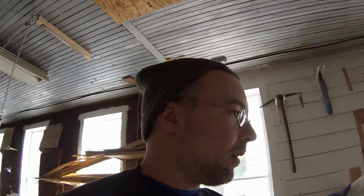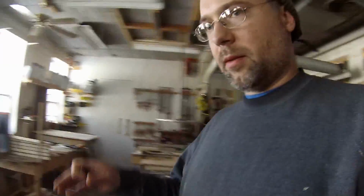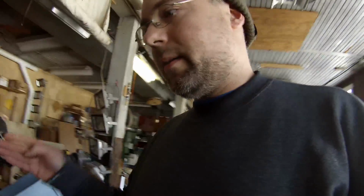That fine dust that permeates all the space inside the shop is the dust that's the least healthy for you, the most hazardous, and the biggest problem that you have to deal with. You don't want that stuff in your shop at any point. So really fine dust that permeates the shop has potential to create very serious hazards. When it builds up into a thicker layer and you have higher humidity weather conditions, that layer of fine dust can actually conduct a charge, so you can get the risk of sparks occurring in areas where you have fine particulates built up into a conductive layer.